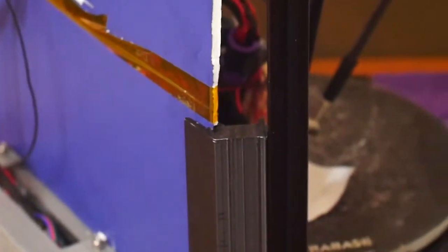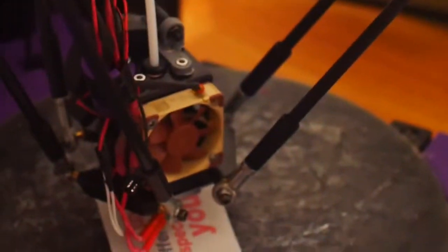The reason you need that is because you don't need quite as much on top. So on the top part, the +4s work. But on the bottom part, you need the +8s. And the reason is because the effector plate, when it swings to the side, needs a lot of clearance, as you can see in here.